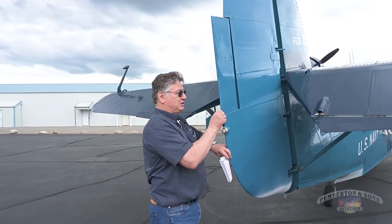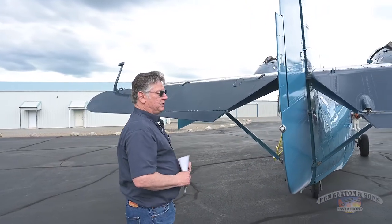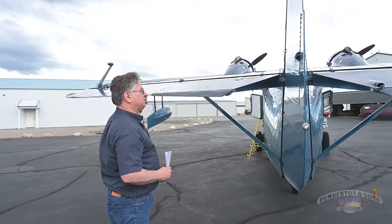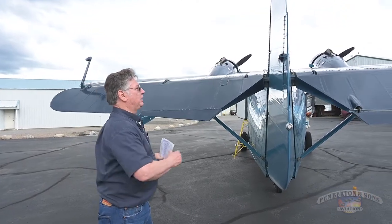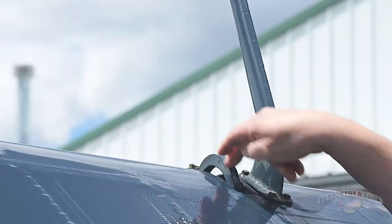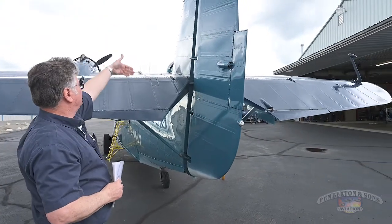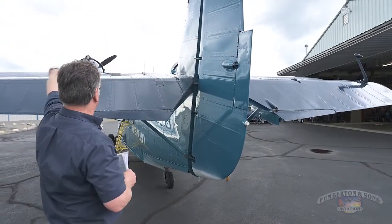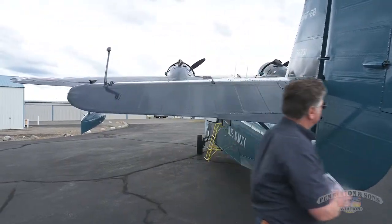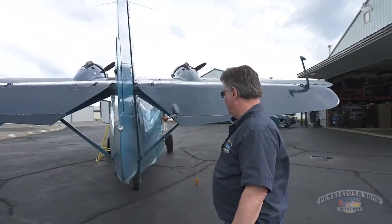The same is true of the rudder trim — that's also tight, and the opposing elevator trim on this side is very tight as well. I'm also going to move the elevator to make sure things are smooth with no scary noises. I can also visually look at each of the hinge points — the big castings that connect to the trailing edge spar of the fin and horizontal — and I count all ten to make sure no bolts have fallen out, as that could be a critical safety issue.